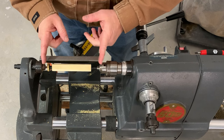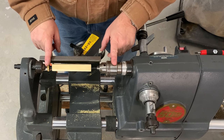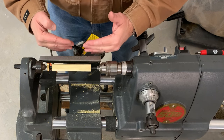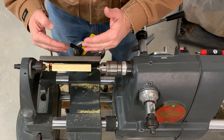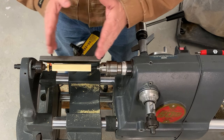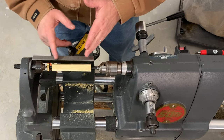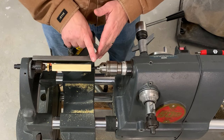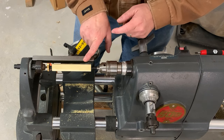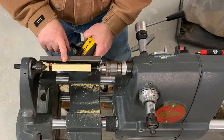So here's the issue. The question is they're using a pen mandrel — we'll talk about how these mandrels mount in just a moment — and with the tool rest set where they want it, some people are not able to get close enough without running into something like the chuck, or they're running out of space. They may be way over to one side and not able to turn the full piece. I certainly wouldn't be comfortable using a skew from that position.